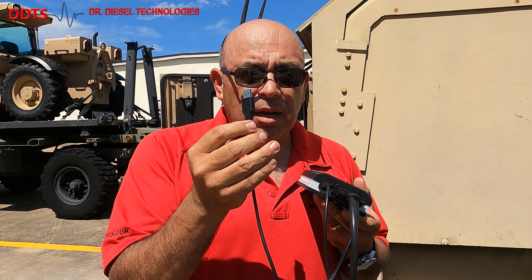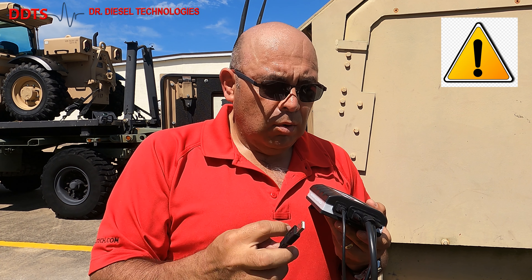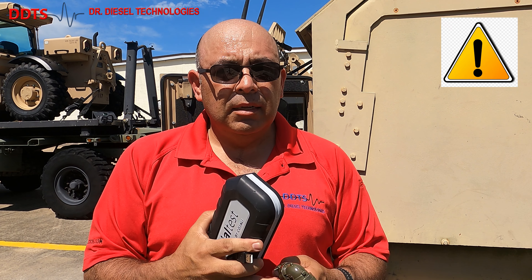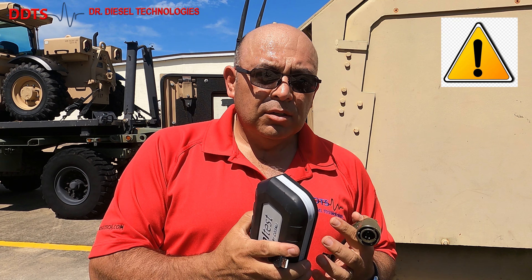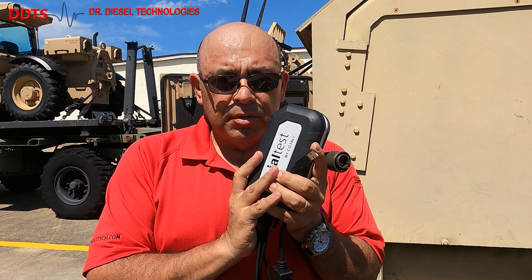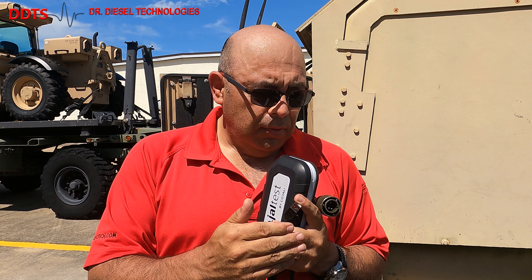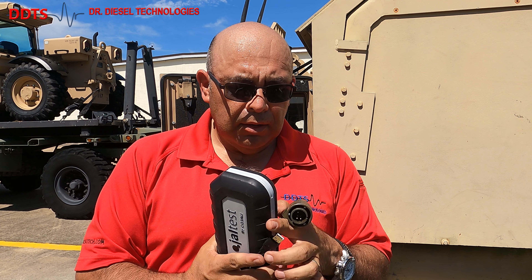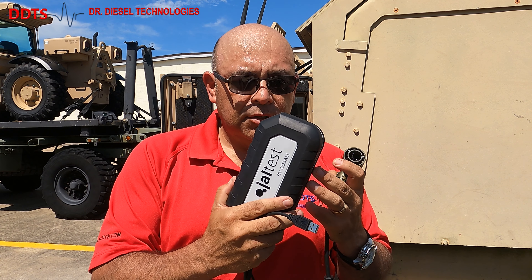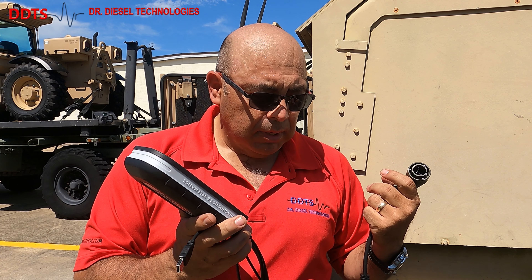This connection obviously goes to your Panasonic Toughbook USB port. One thing I did mention about this yellow tag: when connecting any diagnostic connector to the vehicle, you'll want to make sure that you connect everything to the V9 first, because oftentimes there'll be power on the diagnostic connector. If you connect your diagnostic connector cable to the vehicle prior to connecting to your V9 and the rest of your cabling, you risk the chance of arcing the cable connections.